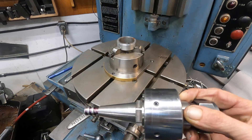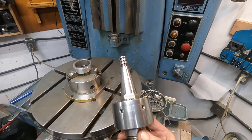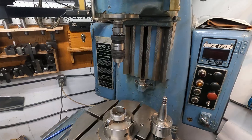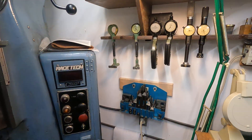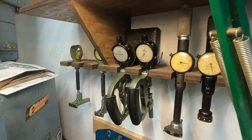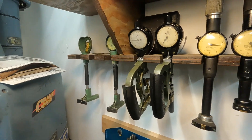Here's what I made — and that's just got a square thread that holds it in. You have to be very careful with these; you don't want to run them into a hot spindle, as it would be very hard to get out. But if your bearings are good, the spindle stays cool. The accuracy is enhanced on this machine, so you can use dial bore gauges and dial indicating snap gauges for measuring tenths, like the bore gauges.